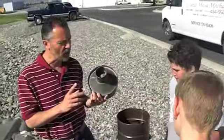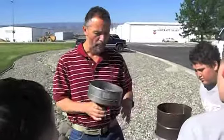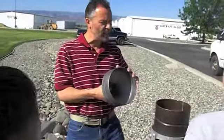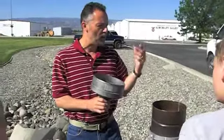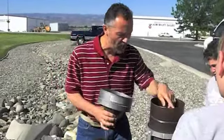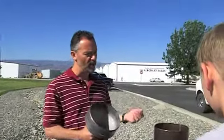In the winter, we don't have the tube and funnel in here, just the overflow container. Because if we have the tube in here, the snow is going to collect on this and there's a chance it can evaporate — and snow can be pretty dry. So what we do is take out the tube and the funnel, let the snow collect in here, and then we'll take it inside, melt it, and measure it.